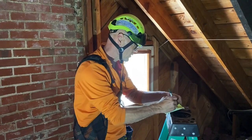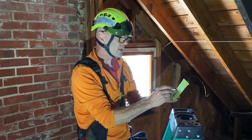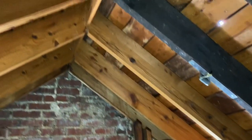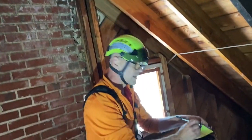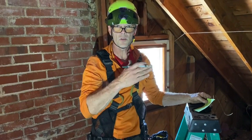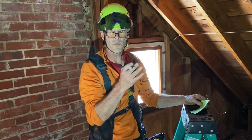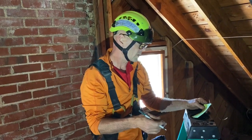No interference with the anchor slot. I'm checking that it's no closer than 18 inches to the end of the rafter — I'm at 24 inches. The reason for that is if you're too close to the end of the rafter, you have the risk of the anchor pulling out, and we don't need to take that risk.